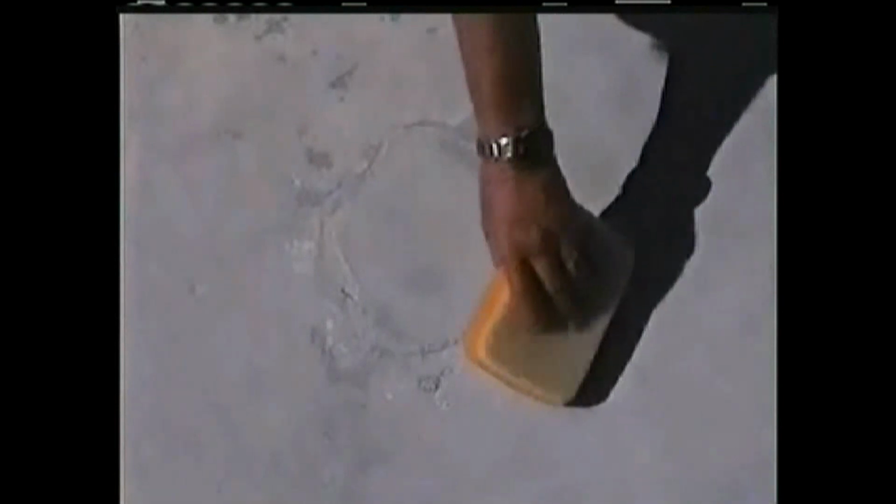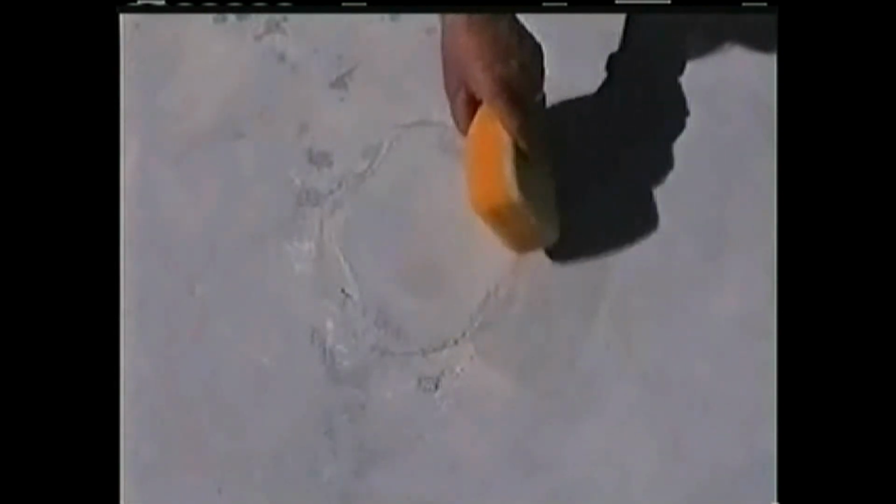After the repair material firms up, lightly sponge the edges toward the middle of the repair. Clean the surrounding area. Now trowel the edges away from the middle of the repair toward the edges to level and fill in the edges.